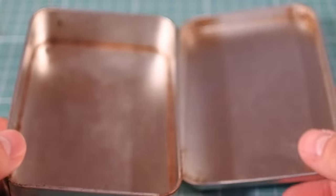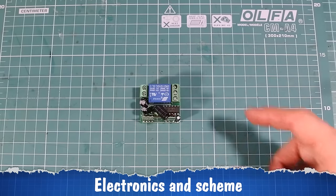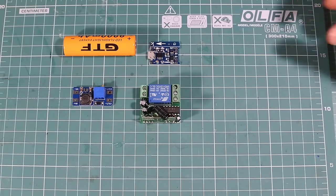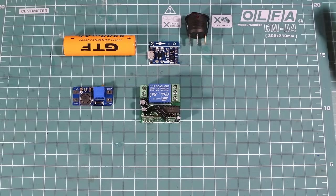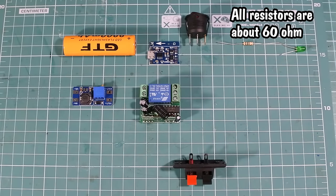Let's see the rest of electronics for this project. Here is the remote switch — it's supplied by a lithium battery and a DC-DC boost-up module. I used this 50-cent module for charge and discharge protection of the battery. Here is the power switch button and a little LED for indication. It's convenient to connect the fuse by connectors like this.